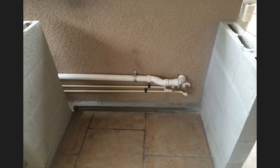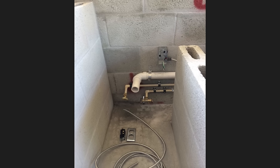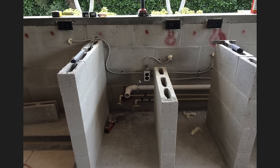I wanted to create a situation where no water could ever get in anywhere, and that also satisfied that need. Here's where I started on the electrical. I did not use the 220, so I capped that off. Here's the 110 that supplies basically the entire outdoor kitchen. Here's the outlet for the top — I think that's the ice maker — and the bottom is switched, originally for a disposal which we decided not to put in. Now the switch operates under-cabinet lights. Here's why I couldn't fill these with concrete: I needed to punch through and snake wiring up, and it would have been a nightmare if I had not thought ahead.